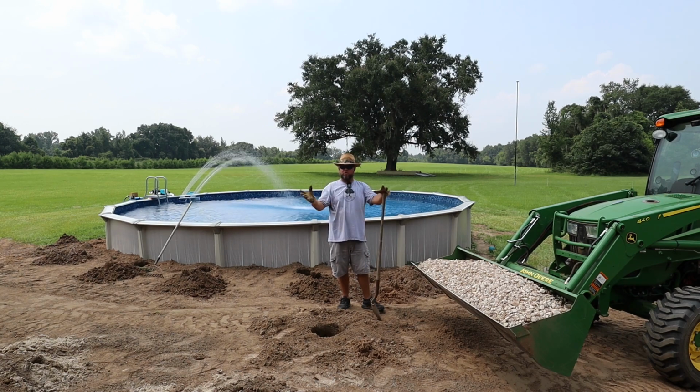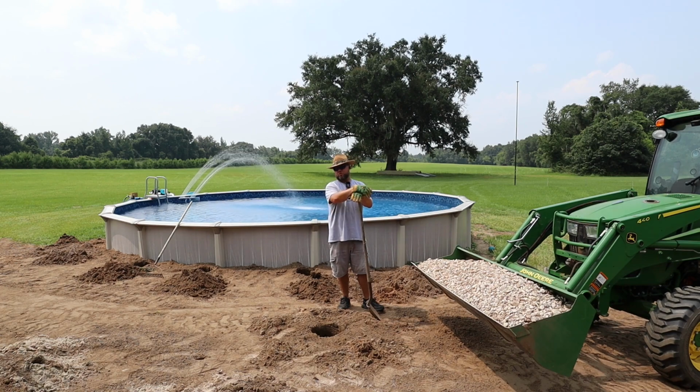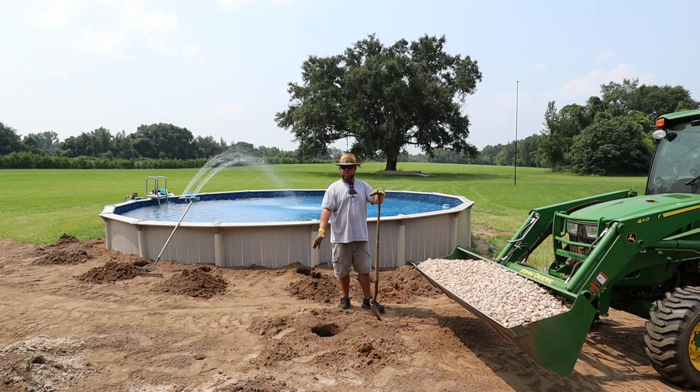Concrete itself is porous, so it will slowly absorb moisture and slowly release it, but it's so slow and retains so much moisture, it can rot a post out. Leave the bottom free draining for rainwater and all the other stuff to freely come out and for the wood to be able to naturally, freely flow out the bottom. It makes a difference, I promise you it does.